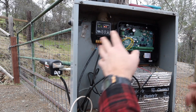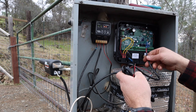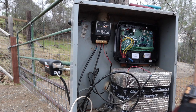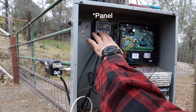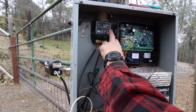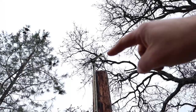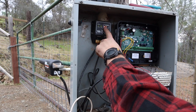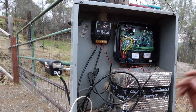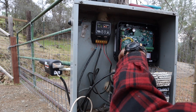First things first, I'm going to mount the new control box. Got the box mounted — I put it inside here because it'll keep it even more safe from the weather. The setup's pretty easy: basically power to the control box via these two wires, and then power from the battery. What I use is a charge controller — basically it pulls power from the solar panel, feeds the battery, and then gives out power to the load. This charge controller is simple: it trickle-charges the battery if needed and doesn't overcharge it. It's just a simple safety, better than going direct to the battery with the solar panel.